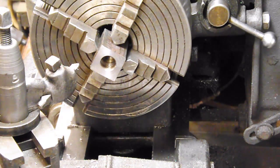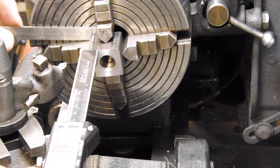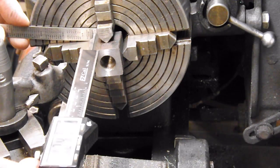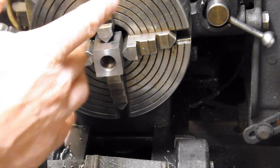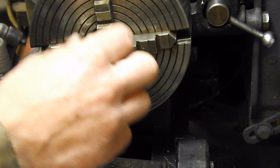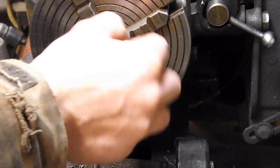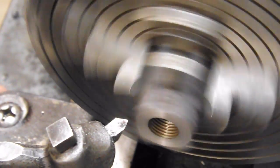That's a much better finish. We are within a thousandth still, and I am very, very excited about that. Not only am I within a thousandth of being square as best I can measure — putting that scale behind there isn't going to tell me within a thousandth probably — but I'm also within a thousandth of the length I wanted. So now I'm actually going to round this off just a little bit on one side because I have a little bit of concern about it clearing the housing there around the cylinder. I'm not sure how much to take at a time on an interrupted cut — I'm a little nervous.